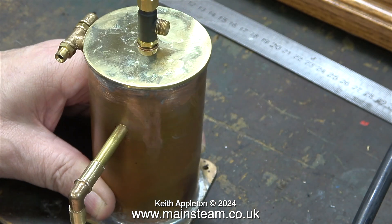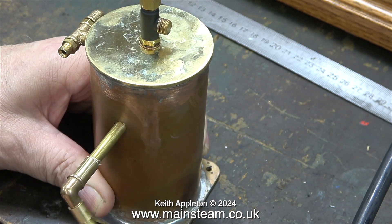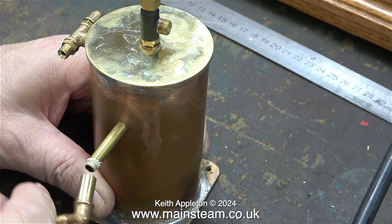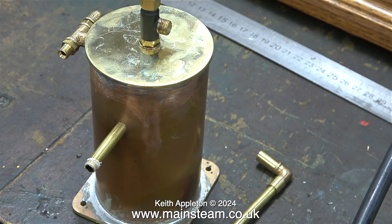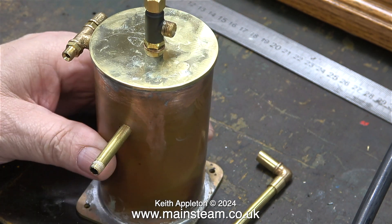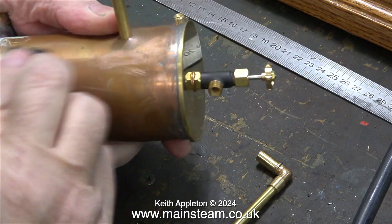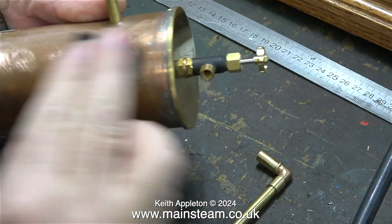The rest of the piping simply unscrews from the adapter I made that fits onto the pipe soldered into the tank. As I unscrew the piping adapter you can see how effective Loctite 542 is as a thread sealant — it almost looks as good as PTFE tape but it's less messy. With all the piping out of the way, the next part of the job is to thoroughly score all of the copper.